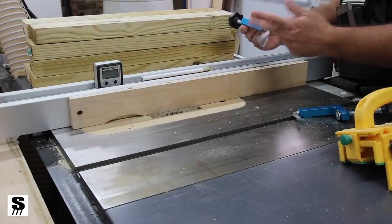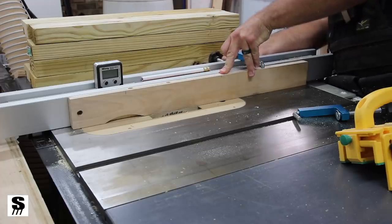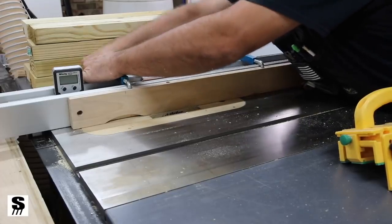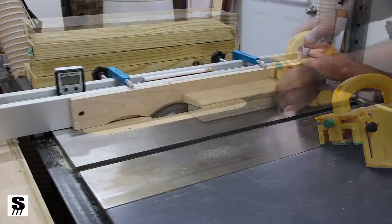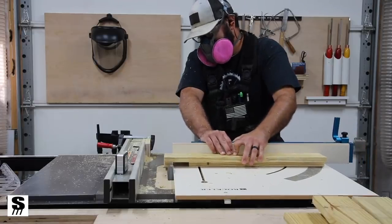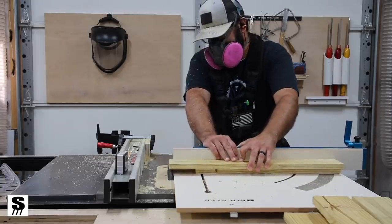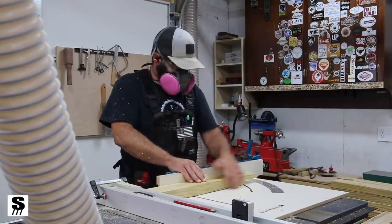The next step is to make the doors, which was actually a fun process. Before I could get started I needed to install a sacrificial fence on my table saw — I've already got a dado blade installed. I raised the dado blade up into the fence at the appropriate height, which will allow me to cut all the way to the edge of the 2x4s that will eventually be the rails and stiles of the door. I'm cutting rabbets into each of the rails so the panel will sit flush with the back of the door, and then each rail and each stile will both get a half-lap joint. I'm using a crosscut sled with a block on my fence